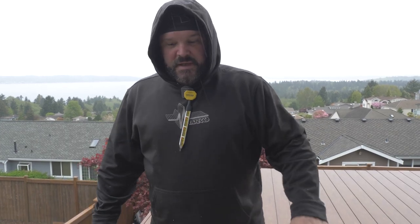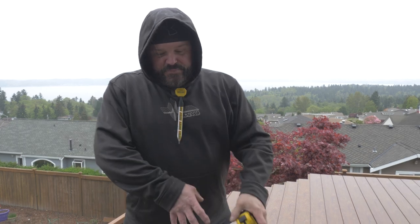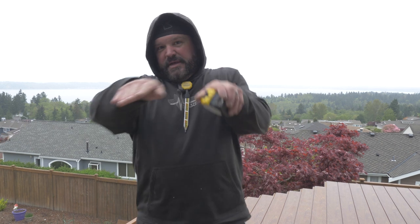There's one more piece of decking that needs to go in right here, and it'll go to this side of this slot. Then there's a T-bar with little barbs on it that gets compressed down after I caulk the whole thing — that's what's going to keep this waterproof and keep the rain out. There are two different slants on the deck: from this point this way the deck slopes one direction, and from this point the other way it slopes the opposite direction, so we have opposing slopes. I didn't frame this deck, so we had to split the seam to get the water to drain correctly. Thanks for watching — please click subscribe and tick the bell icon. Have a great day!